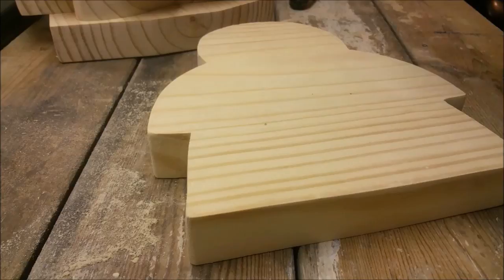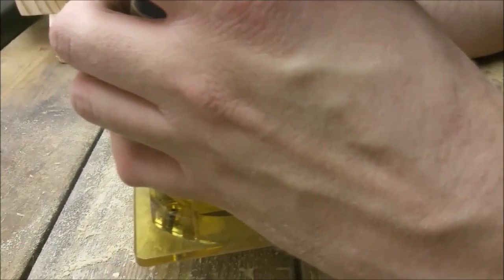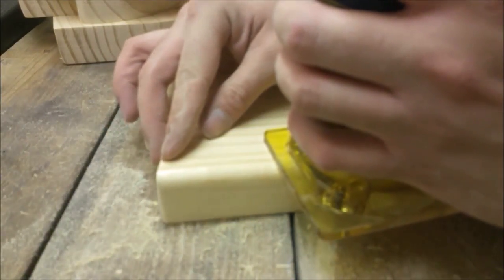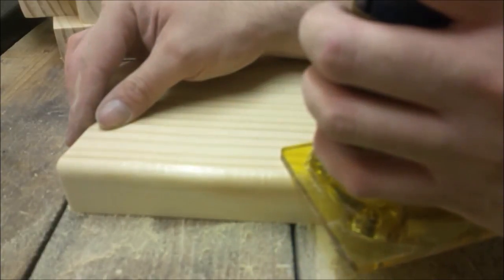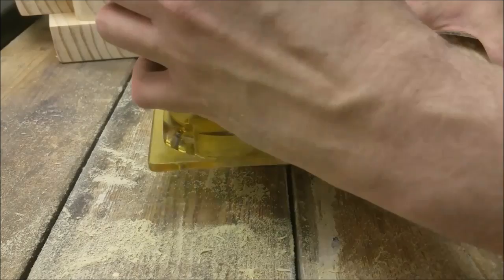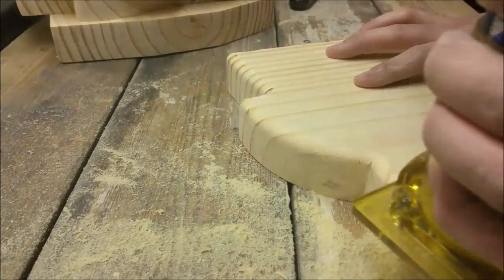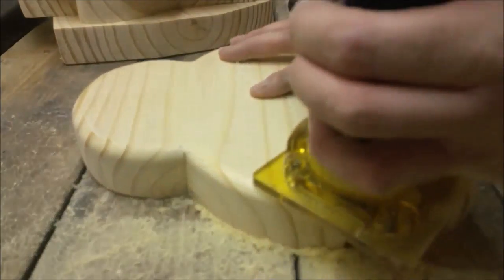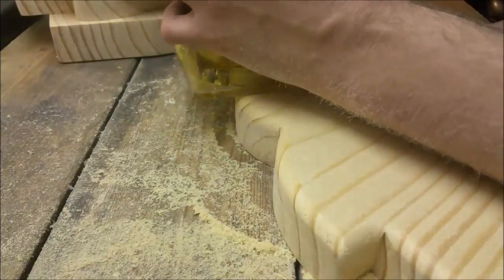The pieces have been fully sanded and now I'm going to use this small handheld router to make the corners nice and round. You can do this by sanding the edges, but it doesn't come out quite as nice as using a router. I like to do this just because the edges are kind of sharp once they come off the bandsaw — it cuts a perfect 90-degree edge and they're a little rough to handle. This makes them feel much nicer when you pick them up.